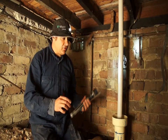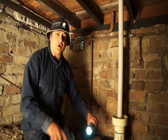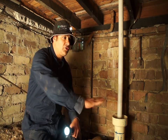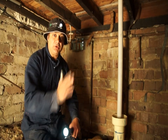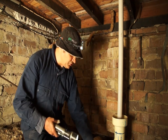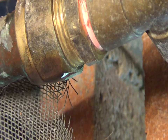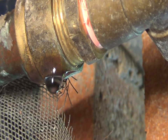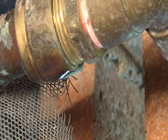When inspecting a subfloor there are a few things to check. Is the subfloor damp? If there is a lot of moisture in the subfloor it attracts termites. You may be able to improve the drainage. In this subfloor the soil seems to be very dry, which is very good. However, I can see there is a leakage happening here, and this needs to be addressed — you need to make sure that the leakage in the subfloor ceases to exist.